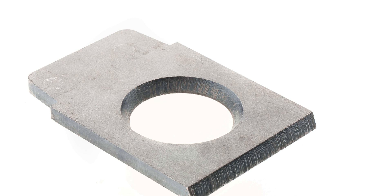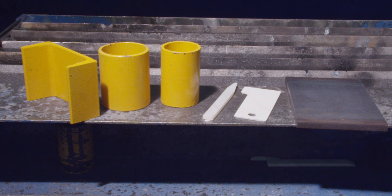These videos will take you through the process of completing a third year cut using oxy-acetylene equipment. The materials needed are a coupon, a 4x6x3/8 mild steel, 2 inch pipe, 2.5 inch pipe, 4 inch standard channel, and a 30 degree angle gauge.